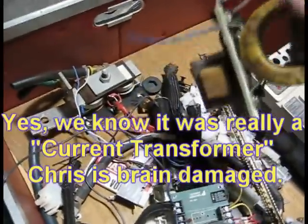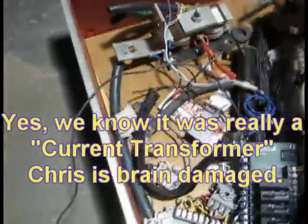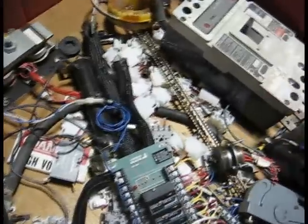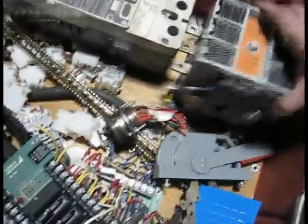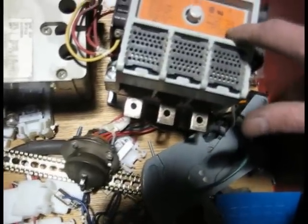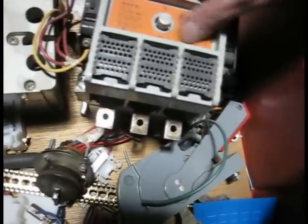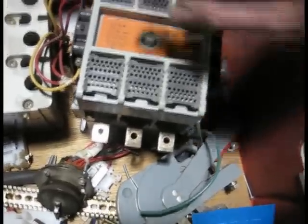Some other nice toys that I saw out of here was this big current metering shunt. This is for measuring current in an AC circuit. Some very nice plugs. There's a pretty serious contactor here. It's a three-phase contactor, and it's good to 100 horsepower at 480, 50 horsepower at 240. That's 135 amps continuous rating. That's big enough for something like Gemini.